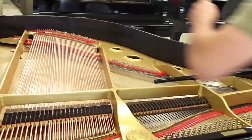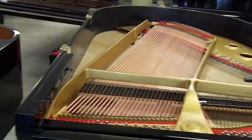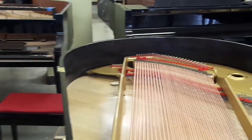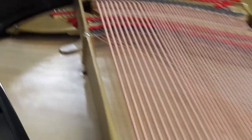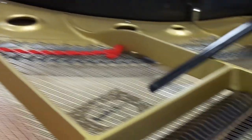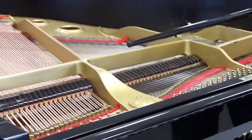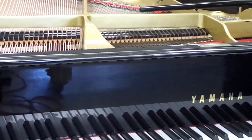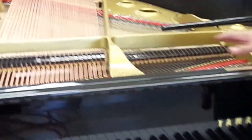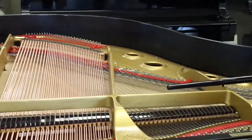This is a 1974 model. When the piano came in, the soundboard was very dirty — it had a varnish finish on it, which tends to turn very dark through the years. So we cleaned that off, sanded the soundboard down, gave it a nice clear coat, and put a brand new set of strings in it. When we take the strings out we really clean it: detail the inside, shine up all the brass, polish the duplexes, every bolt comes out and gets cleaned.